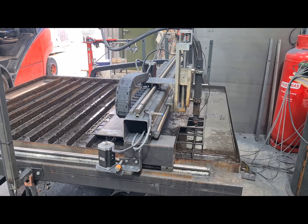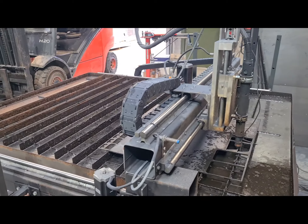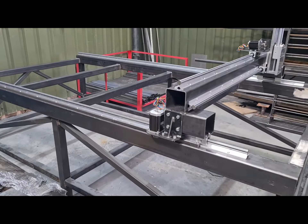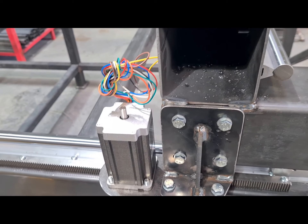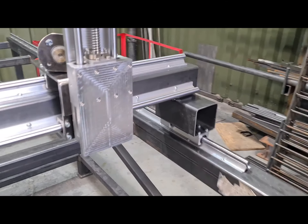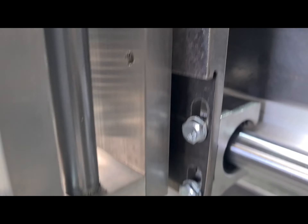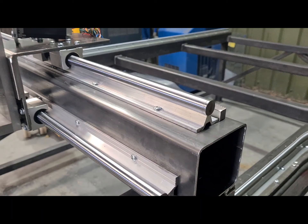I just love building this machine and the way it works - I've surprised myself. I've beefed mine up a little bit more because I'm hoping to get a little bit more speed out of mine. A lot of the reason for beefing up all the components - the motor mounts nice and strong, gone from 5mm to 6mm - it might not seem a lot but it makes all the difference when it comes to rigidity. Little things like those adjustments - although that one is at the extent of its adjustment so the next one might need some modification.